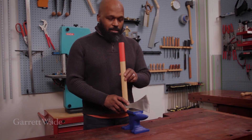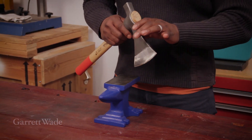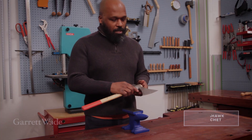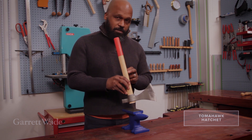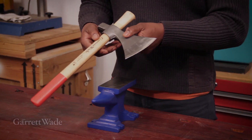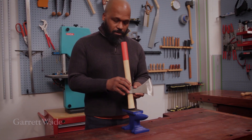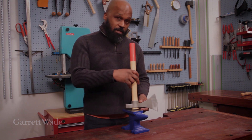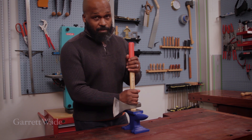This is the Garrett Wade Tomahawk. It's a beautiful and really handy tool for taking camping or just for general bushcraft. It's a little unusual in that the way the head fits onto the handle involves driving two wedges together. The handle is tapered and inside the eye of the head is also tapered, and fitting them together permanently to get it ready for work means getting a snug fit between the two.